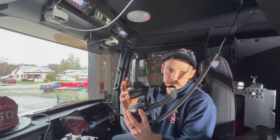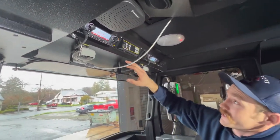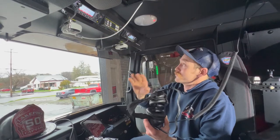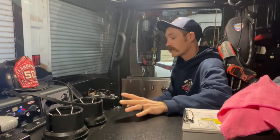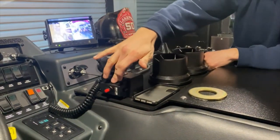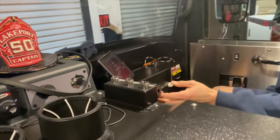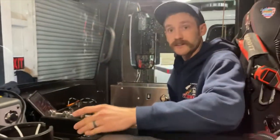The system is also equipped with a push-to-talk. On your Fire Comm headset, you have a volume control as well as Radio A and B selectors, which you can program to talk on — Radio A being command and Radio B being tactical. We've also added two remote push-to-talk buttons so we can freely transmit on command or tactical through our headsets. The first is on the engineer's side — a red button — and the second is on the officer's side, the same red push button mounted on a custom fabricated mounting system.